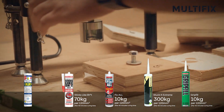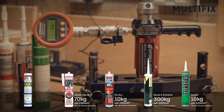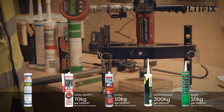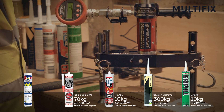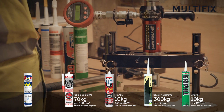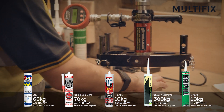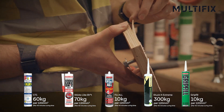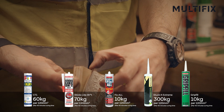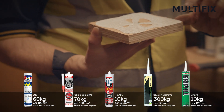Final one, CT-1. We got to about 200+ kg before that broke apart. As you can see, that one did slightly start to delaminate the ply as well, but it was clearly the glue bond that broke first.